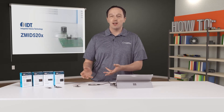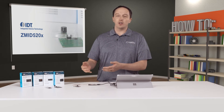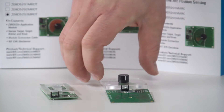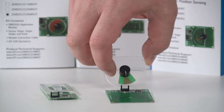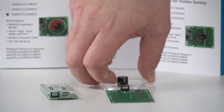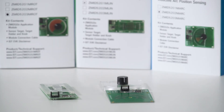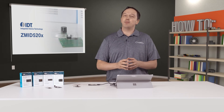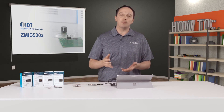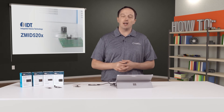By the way the coils are designed, the voltage that is generated is shifted 90 degrees between the coils, which generates sine and cosine-like waveforms. The target is just a PCB with some of the copper plane left in place, but the target can actually be any type of metal. As it moves across those coils, the voltage generated by the receive coils depends on the position of the target. This technique uses a ratiometric measurement of the receive coil voltages, which makes it very robust against changes in the air gap between the coil and the target, enabling a contactless, magnet-free design that won't wear out.